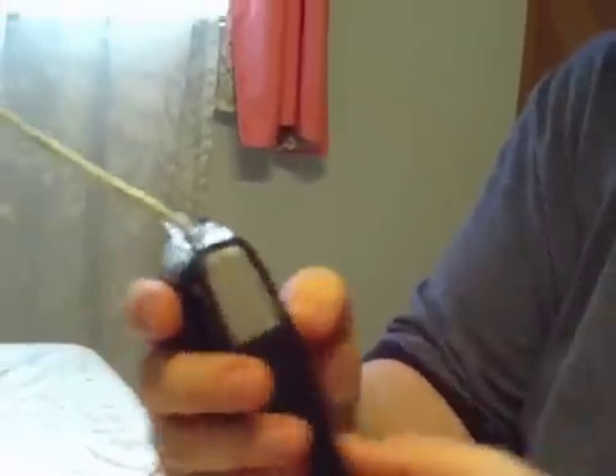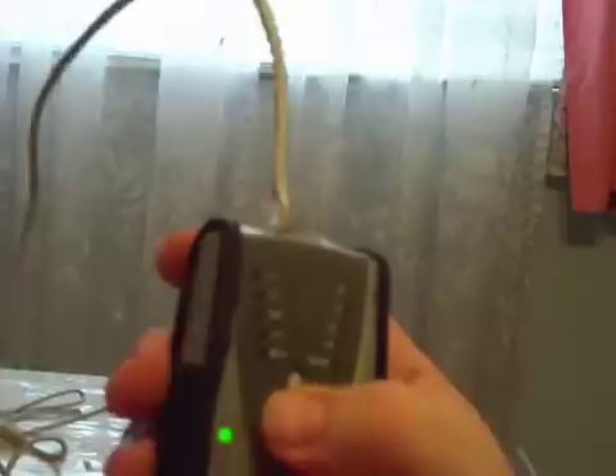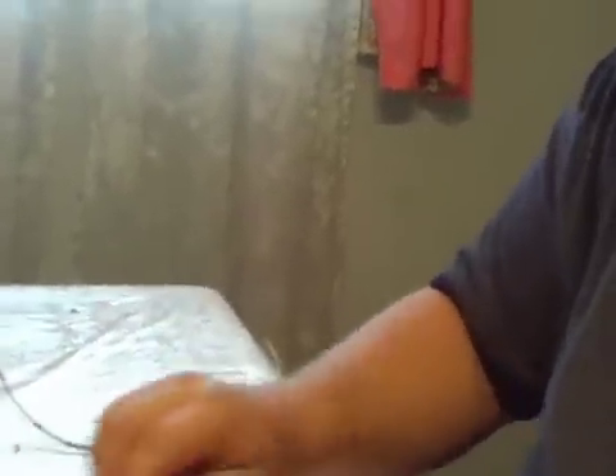Let's go ahead and put it in our tester and see what that looks like. And in this case, three and six are crossed. Notice the crossover light comes on here — this is letting me know that I have a crossover cable. Hit it again, and three and six are crossed. Thank you very much. And this concludes our session for Network Media and Category 5 wire.